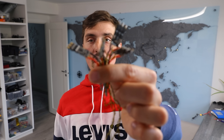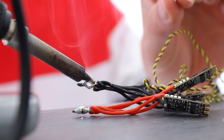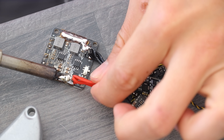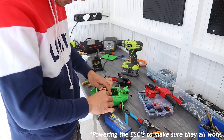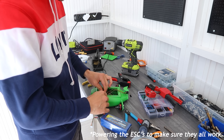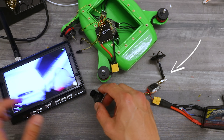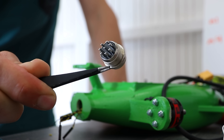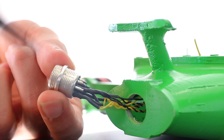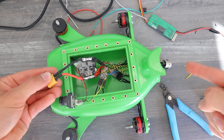The next step is to take the four bi-directional ESCs and connect them to each motor. I also have a power distribution board that's going to be connected to all the ESCs. The speed controllers are all connected to the power distribution board — you could just do it with wires but this is just way cleaner. Now in order to have a live view from under the water there is a camera inside the drone, a video transmitter inside the flotation box, and then a video receiver that I will be holding. I started soldering all the video signals and the ground wires are all connected. The PDB is powering the camera and the video signal is going to the eight pin connector.